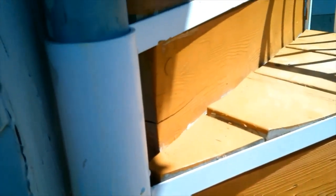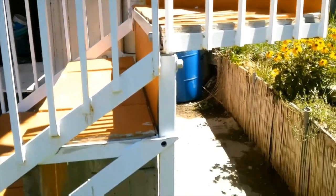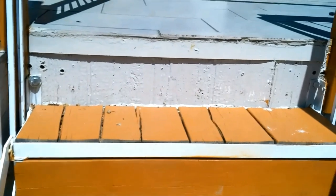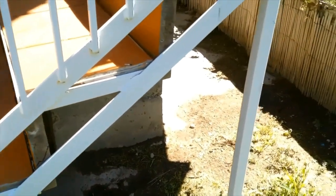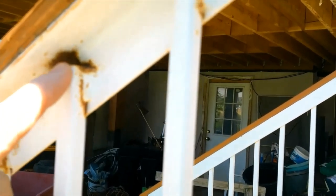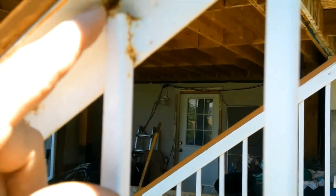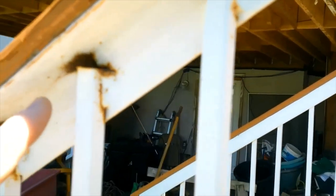The whole concept of a spiral staircase is to be self-supporting, but I do have a couple of added supports. To help support the straight section I have one support going down into the ground. The front of the stairs is also anchored into concrete, and the upper straight section of stairs is bolted into the wall of the house. Each rectangular stair piece is supported by two parallel 1.25 by 2.25 flat bars. The spiral staircase is about 8 years old and is showing some corrosion in sections where the powder coat was not able to bond well to the metal. If I could do this over I would have had it hot-dip galvanized and then powder coated.